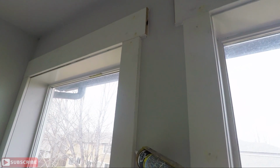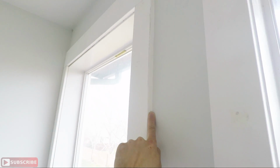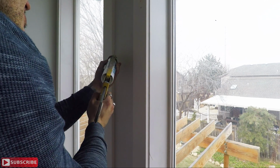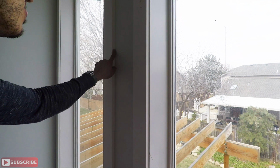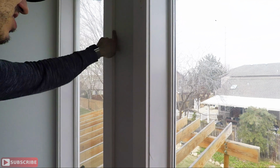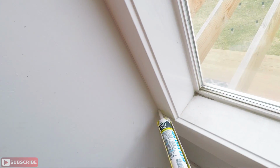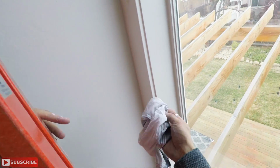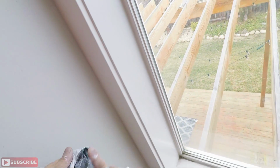That's very, very important. When it comes to applying, create a small cut, apply it, and then here's the kicker. Get a damp rag. Get your finger wet in it. So once you apply it, use a finger that's already moist from the water in the rag, and then just do one swift motion to push all the caulk behind the trim. This will actually make sure it looks nice, flush, and actually uses it to be an adhesive for the trim.